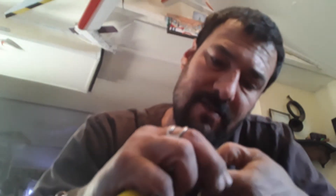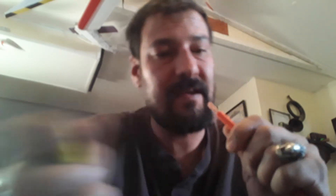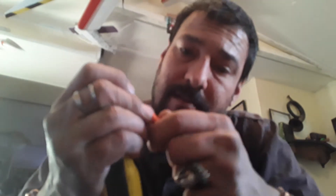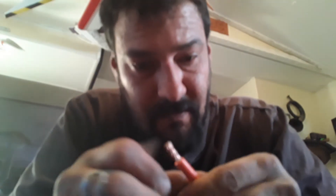Then you get your lead and put your thumb over here, because you want this to end right there. But this part over here we're going to have to shave down a little bit because this is an 8-gauge, not a 10-gauge. That's why I'm doing this video — there are plenty of videos on how to do this connection with the right gauge wire which is 10-gauge. This is 8-gauge, so we're going to have to trim this down a little bit. We can technically go all the way to here and put the end here, but it's not going to be really watertight. So we cut halfway in between and then get your razor and shave down to that line that you cut.